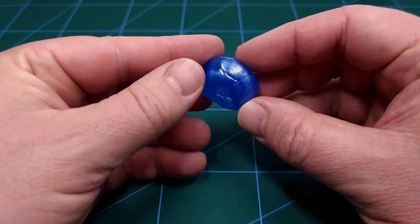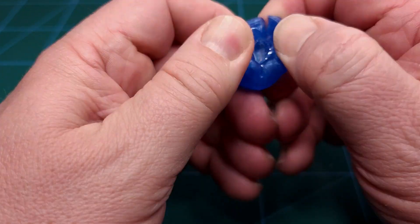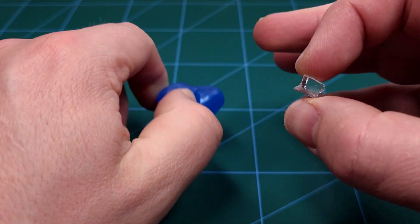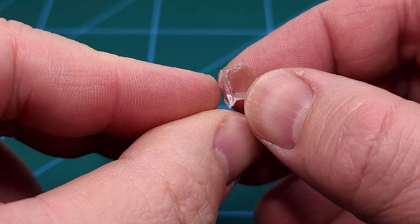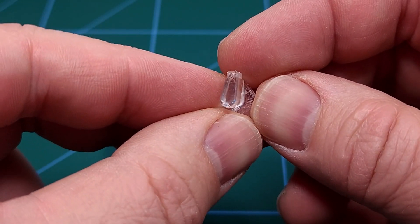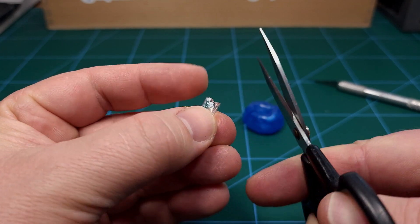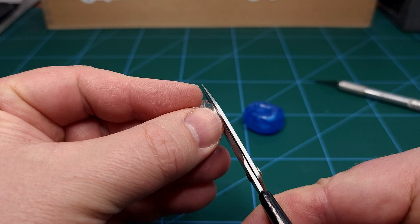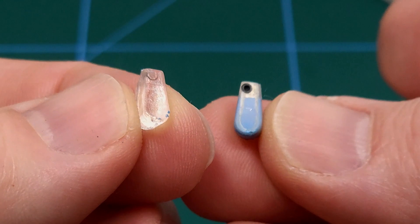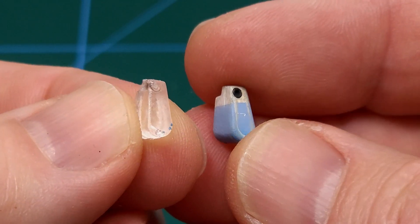This is attempt two - it looks a lot better this time, the mold is also quite hard. I decided to cut away the mold around the molded part, and there you can see - absolutely gorgeous, that is the result I was after in the first instance and I certainly can't complain about that. Even the little cap is visible there. Next I remove the excess resin - this is soft enough to cut away with a pair of scissors - and there we go, a perfect copy of the original styrene part.